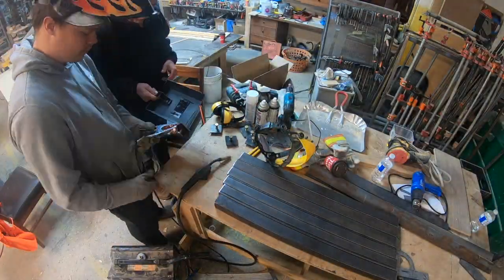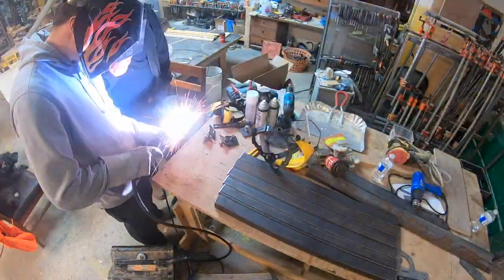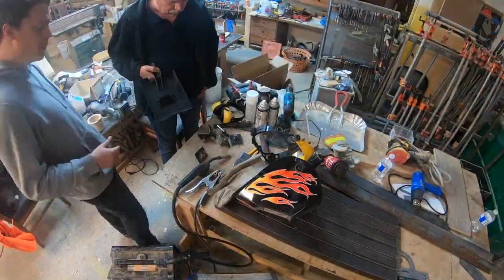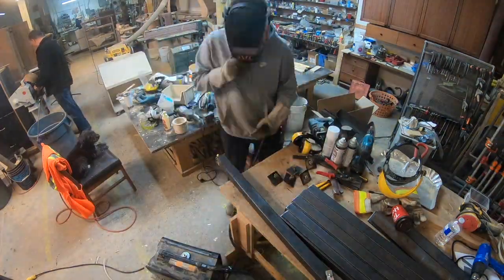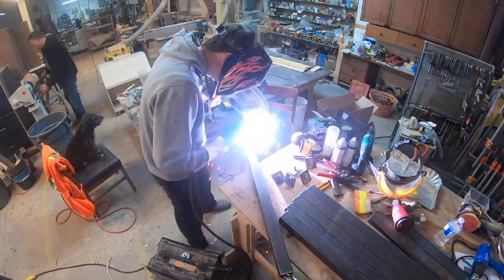After drilling a hole, we're going to get a nut and install it on the hidden portion of the plate. Once we complete that and attach it to the solid legs, we can now put a bolt in there, and that'll allow us to adjust upwards or downwards. Because we're not dealing with relatively flat floors in the shop, it'll allow us to evenly distribute the pressure through the 6 legs.